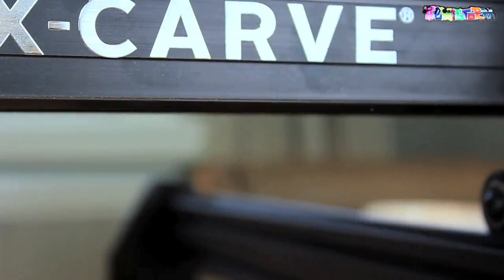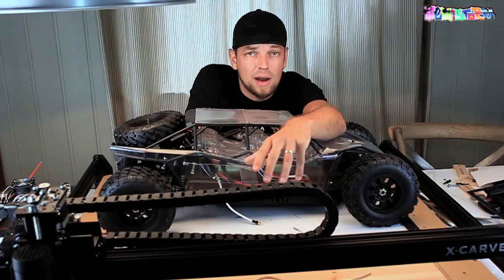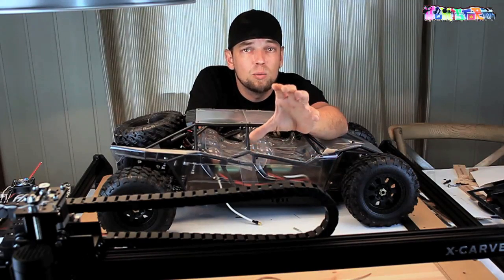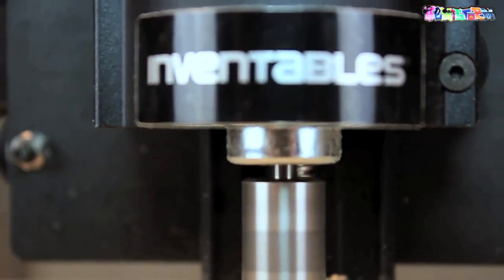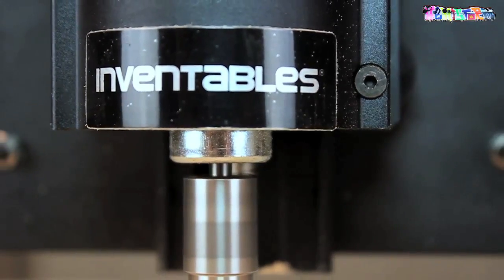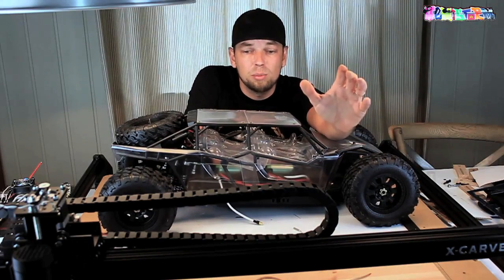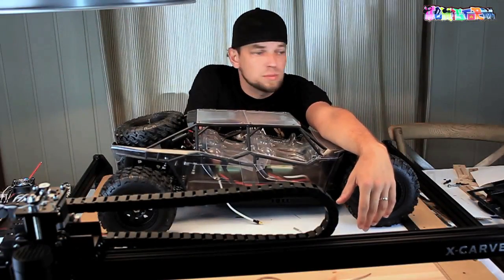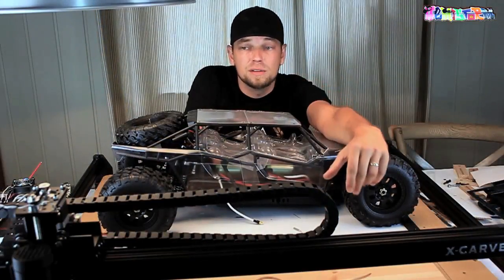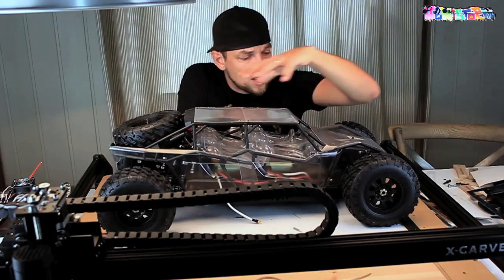I'm not just making wooden parts on it, because a lot of people misunderstood. In my previous video I showed how I carved a piece of wood — that was just a calibration piece. I will be machining, and have already machined, RC parts on this X-Carve. I ordered some Delrin and some carbon fiber on Inventables.com — link in the description. Delrin is a super strong plastic; carbon fiber is rigid, tough, looks super cool, and you can machine it. Aluminium can also be machined on the X-Carve, but I'm not doing that with this project.